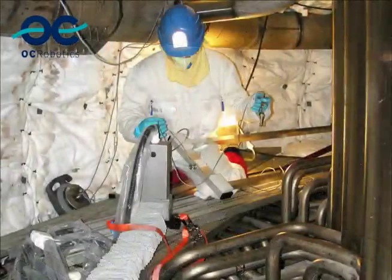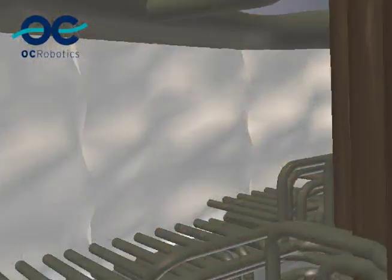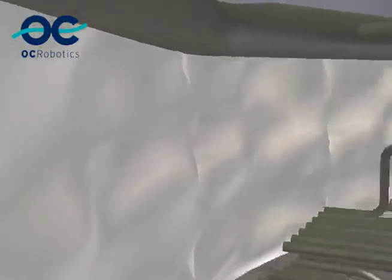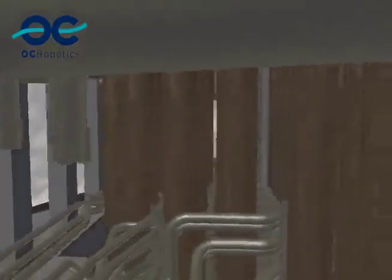You can see there's really very little space to move around. The pipe that we had to replace was part of this mass of pipes that you can see in front of you. The reason for needing the robots was that access to that pipe was down this narrow 80mm wide corridor, around avoiding these pipes, and then down.